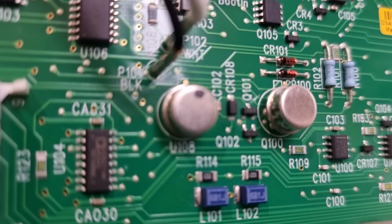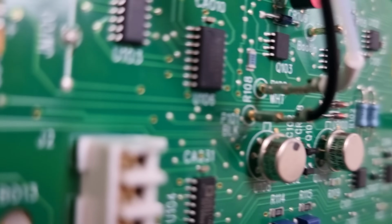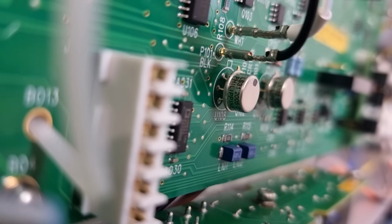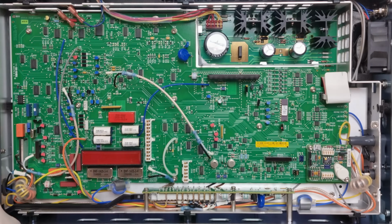No exceptions. All of the leaded transistors in here, mostly single or dual matched JFETs, have a part number starting with LS. The Linear Systems website has datasheets, SPICE models, and spare part availability for most of them. That's wonderful. Before it was always a guessing game with HP internal part numbers. I haven't looked too deeply into all the SMD components, for example, but the changes that I have spotted on this board all seem very reasonable to me.